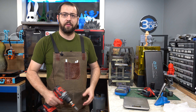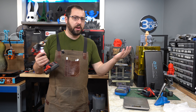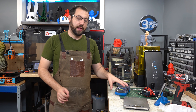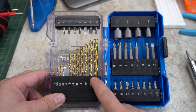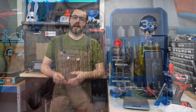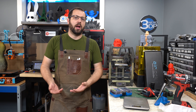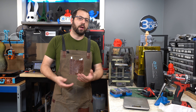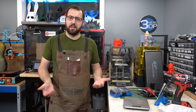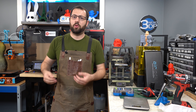There's always the bigger brother of the electric screwdriver: an electric drill. You probably have one, and if not, you'll want one around the house anyway. Tied to that, get yourself a set of drill bits — metric if you can, since most things in 3D printing are metric. A good drill index is very handy, especially when printing objects that need to fit together or fit screws through. Many designs aren't made with certain plastics in mind or don't have correct screw holes — someone designs an M3 hole at exactly M3 size, and if you overextrude even slightly it won't fit. A good drill index will definitely help when reaming out those holes.